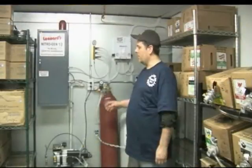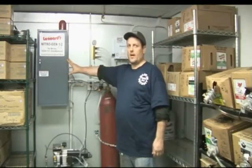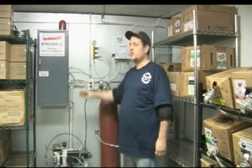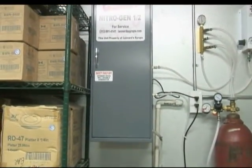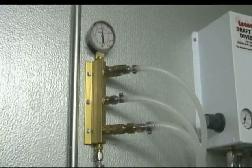This system is comprised of a nitrogen control box, which has a membrane inside of it that takes compressed air and turns it into 99% pure nitrogen. It starts off with the air compressor taking air from the atmosphere and going into the nitrogen generator box, with nitrogen out coming out to a tri-fold, which is through your backup system.